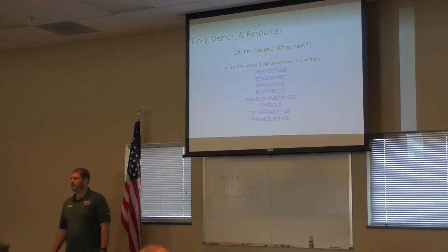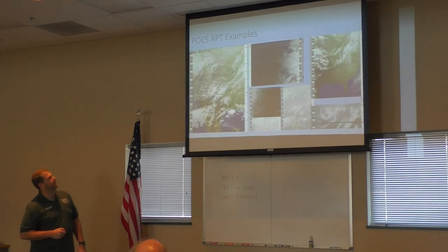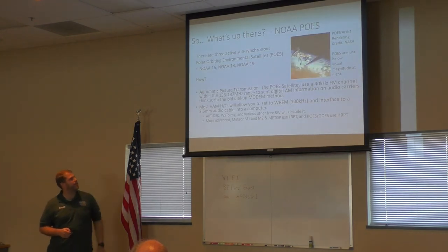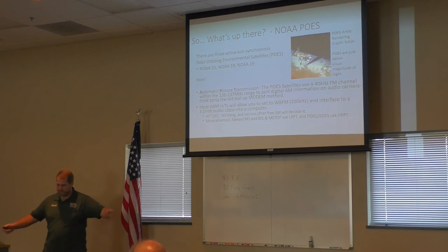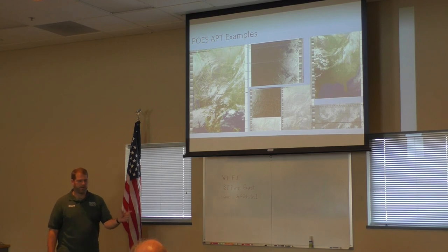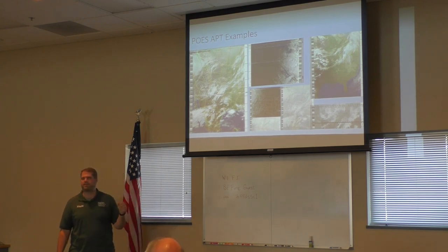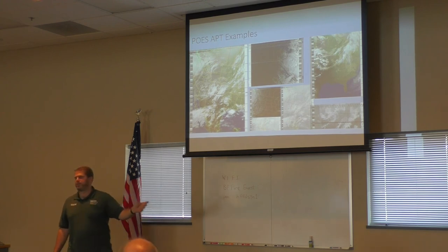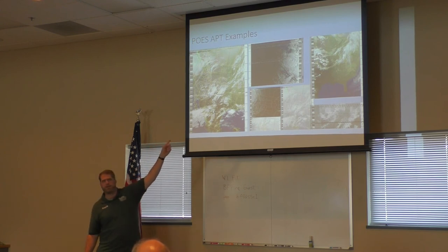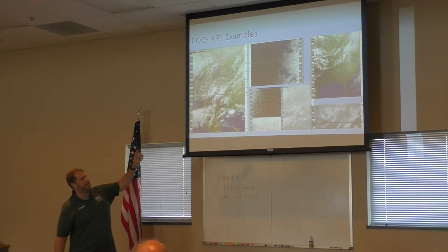Have you played with that where you download the NOAA maps? Yeah, that's what I was just gonna go, since we got 2 minutes. Here's another thing that you can do. You can tune to VHF and download a low resolution 4 kilometers per pixel image from the weather satellites. It's a 40 kilohertz wide FM band, so most of our handy talkies will let you listen to about 137 megahertz. You'll open it up to wide FM, so you'll be getting a little bit more noise. If you've got one of those RTL SDR dongles, you can tune all of that down and sync it up right nice. And you'll listen for an analog signal.